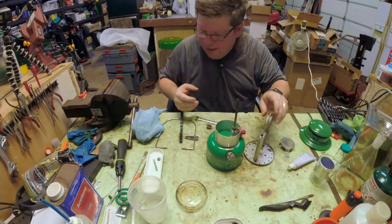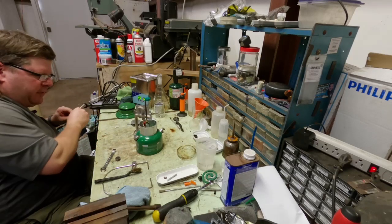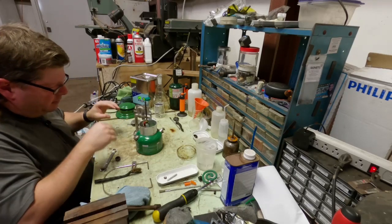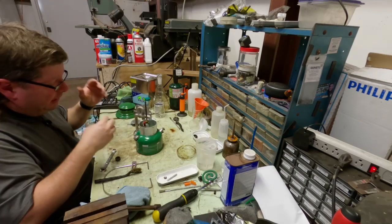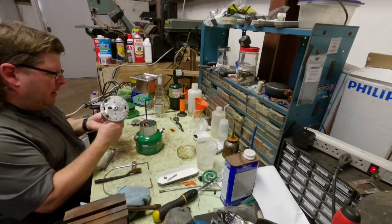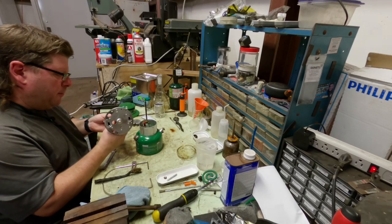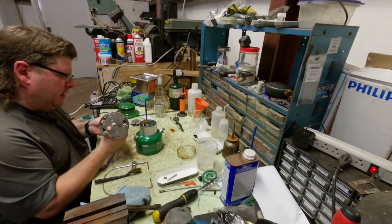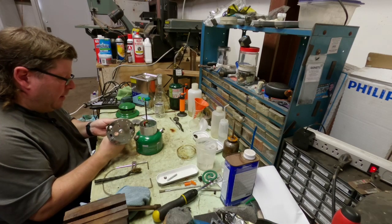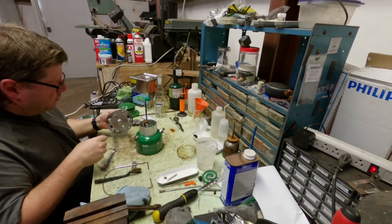So you don't want to have it on there such that it'll never come off. But the problem is that with this stuff, you will have expansion and contraction, because it heats up and gets cold, heats up and gets cold, and it gets hot, right? So you know this is probably getting up close to the 1,000-degree point. And with dissimilar metals, because this is brass, and I don't know if that's steel in there. Maybe it is, maybe it's not. Then it wouldn't be dissimilar metal. But at any rate, it is going to eventually work its way out and fall off.